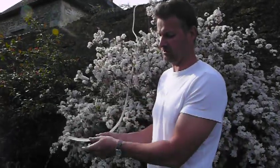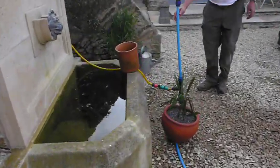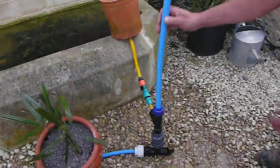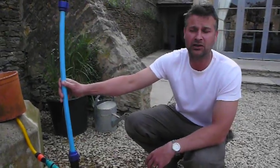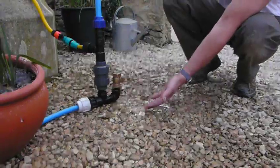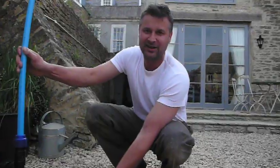The design's hardly changed. They're made as heavy castings — the commercial ones — but ours is just a little model. It works fine, and you can use this if you've got a stream to pump water. This actual model here probably cost about £40 in parts to build, and that's not bad. Some of the big commercial ones start at about £500-600. But if you've got a little stream near your house and you want to raise water to irrigate your garden, you can fill a big water tank, draw pipes off, and irrigate with it. It's free energy. You're pumping about 10%, and the rest just goes back into the stream — so it's not really wasting water. There you go — your hydraulic ram.